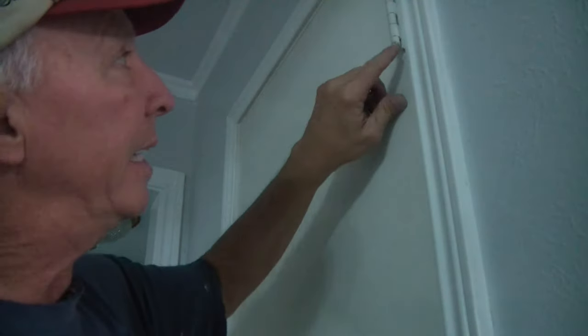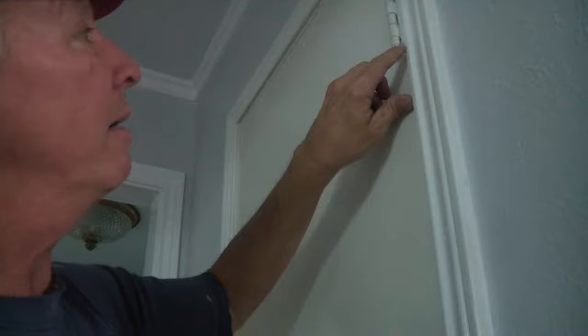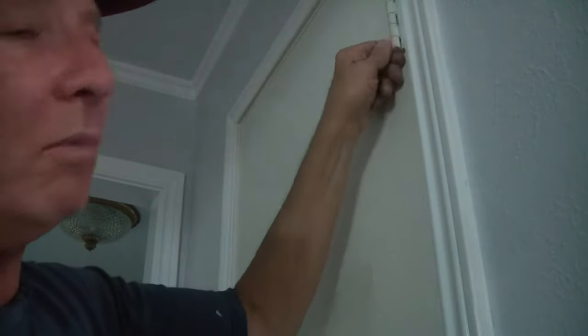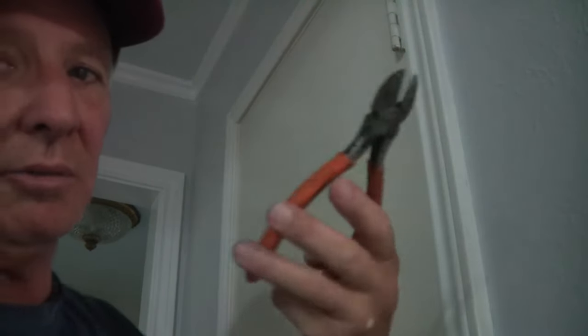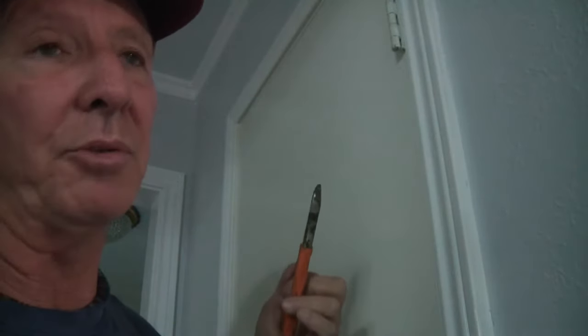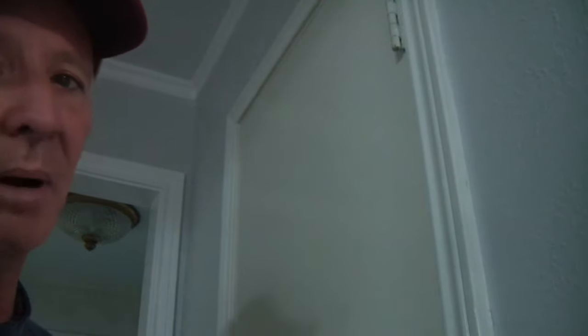The reason I do that — a lot of times people just paint these hinges and there'll be paint all over in here. So instead of using vice grips and grabbing on this, I don't want to mar that up. That's why I use dikes. These are just some dikes that were in my car since all my tools are at home. This is how I pop them off.